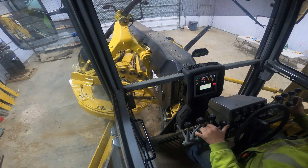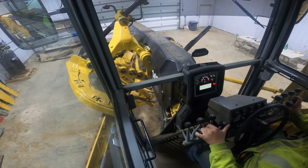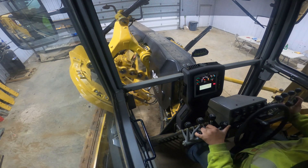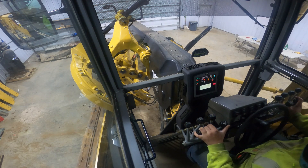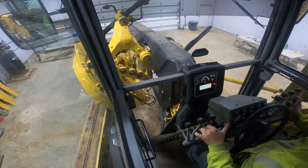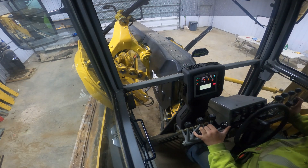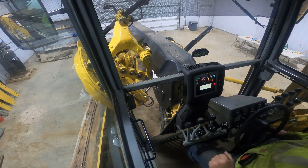So what I'm doing here now is I'm lifting up and pushing out — lifting up on the left side and pushing down on my right hand side — and that's causing my table to come upwards. And then I'm bringing my circle back down also. So now I got it all the way pulled up here. I rotate my circle back down a little bit to level it up, side shift the blade just a hair, and that's how I pull my saddle down.